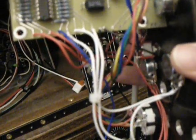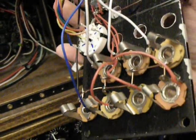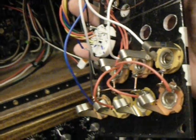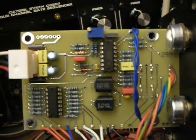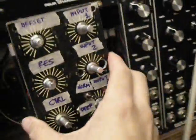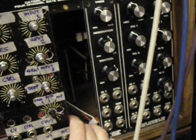Let me show the back of the module — there's all the audio connectors. I like to use the rotary switch; you can use a three-pole double-throw switch if you like, 3PDT. I had to use cheap jacks here because I'm waiting for another shipment to come in — didn't want to wait to get this out to you. Thanks for checking it out. Hope you're interested in the PCB. If you are, check out electromusic.com and look for the low-pass gate forum and we'll get you set up. Thanks so much for checking it out. See you later.